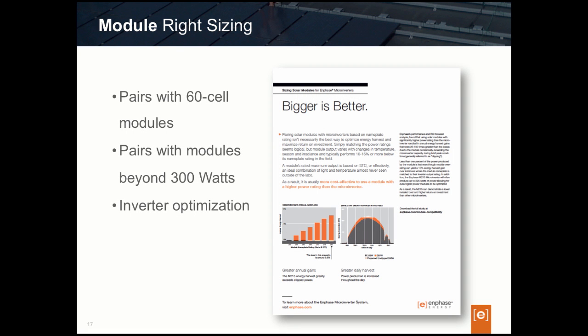When using the M250 microinverter for your project, there are a few design considerations to keep in mind. The first is to understand what module to pair with the M250. The DC input voltage of the M250 is well-suited for today's 60-cell module technology. Under certain circumstances, the M250 has even been paired with 72-cell modules, but the 60-cell solar module is really the sweet spot. Because of its higher power capability, modules of 300 watts and better are good matches for the M250's 250-watt CEC-rated output.